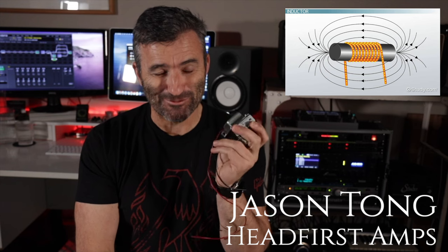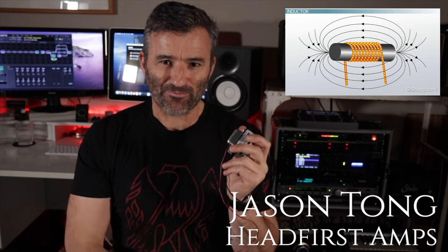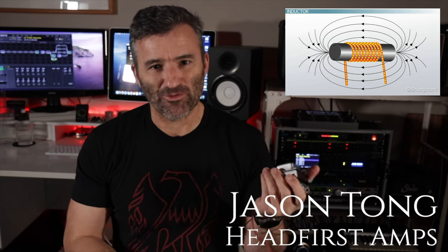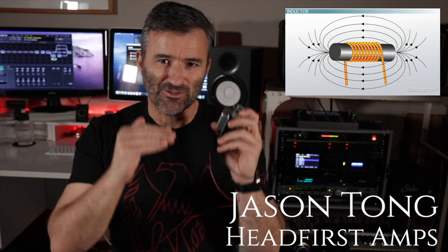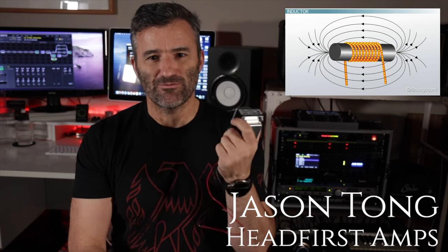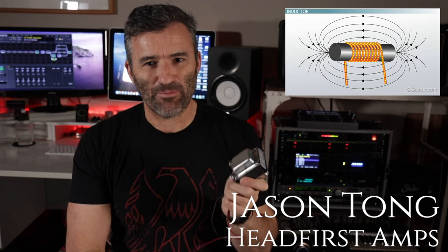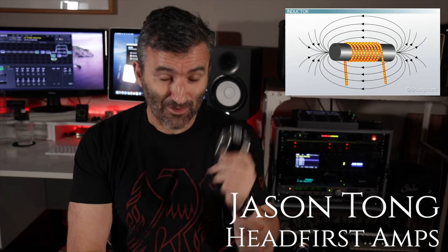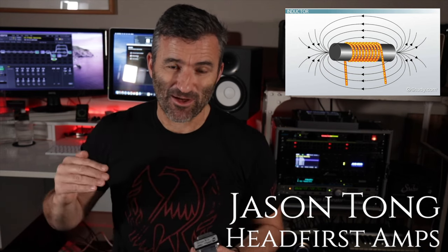The second property of an inductor, which is quite amazing, is that it stores energy as a magnetic field, right? So why is that important? Well, if your current drops, as you know, when you use the amp and hit it hard and you've got it cranked, you can get a fluctuation in the current. The inductor or the filter choke, the magnetic field will change and it will release energy back in as current, right? So it can store magnetic energy and release it as electrical energy, giving your amp a bit more bounce. So there you go, that's the purpose of the choke.